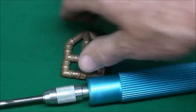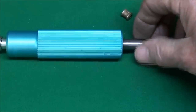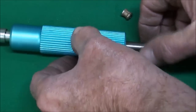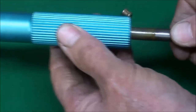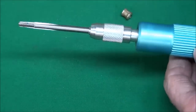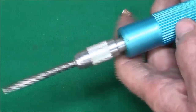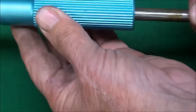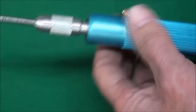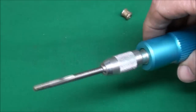This is the tap wrench I was using - in this particular case it can be held right in a 3/8 inch drill chuck. This was held in the chuck and this slides in and out, so it feeds itself and will hold taps. This is about the maximum size tap that it holds. Worked pretty slick, I must admit - first time I've used it since I've owned it, although I have several other homemade ones of similar construction.